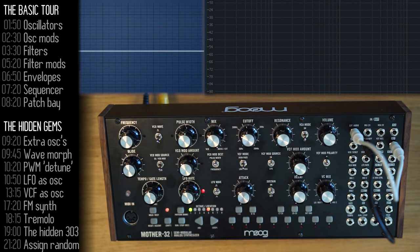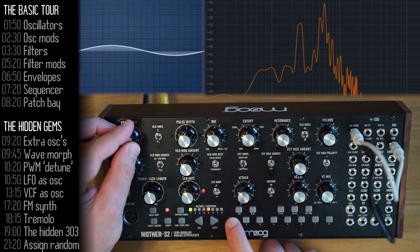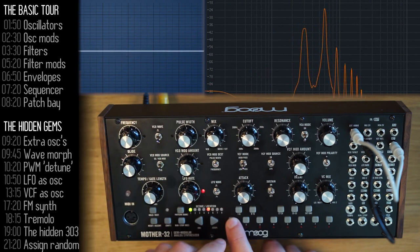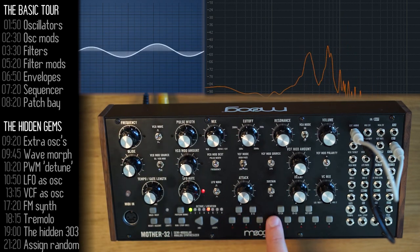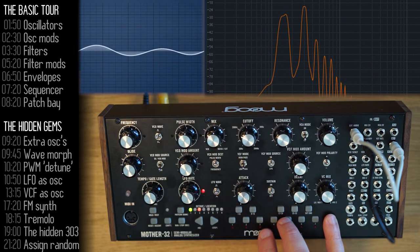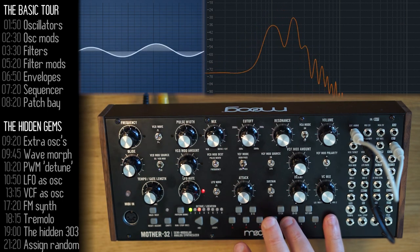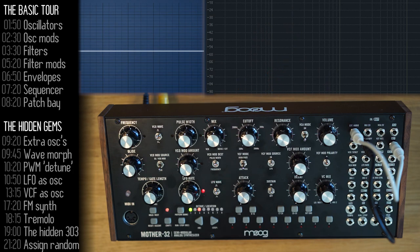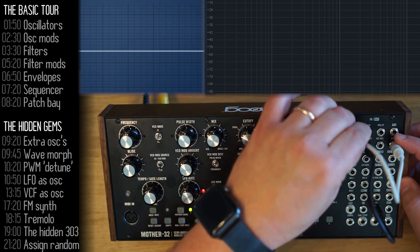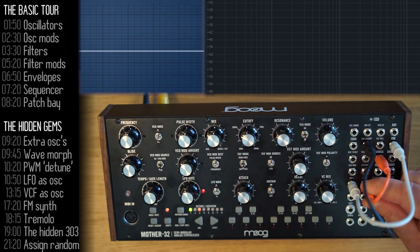Now we have a fully controllable self-oscillating filter. We can bring back our main oscillator, tune them to each other so they play together, detune them relative to one another, or have them play in different octaves. You might say — and if you don't, I will — that it's nice, but because I'm using a filter, I'm cutting out all the sawtooth wave harmonics. The way to fix this: there's a second mixer in the Mother 32, the one in the middle that doesn't go through the filter.